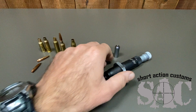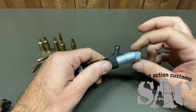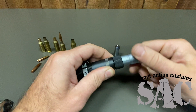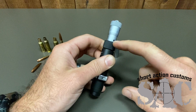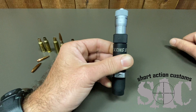It's a pretty cut and dry die — very concentric, very well made. We're using a Mitutoyo micrometer head. There's a half-inch of travel, and we went ahead and machined a special detail: there are no set screws and it's completely tool-less, but we've increased the amount of tension that this head has. So you've got a super good positive feel to it — as soon as you're done turning, it stops. It's almost like it has a brake built in to increase drag. The thing is, you're not going to accidentally bump it and rotate it; you purposely have to grab it and turn it to get it to move. Just like other dies, there's a little 1.5mm Allen wrench so if you loosen this up you can spin this scale around to zero it, just like a turret on a rifle scope.